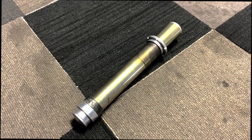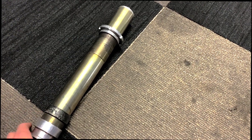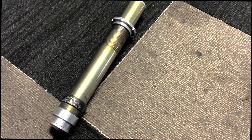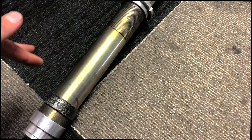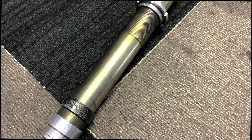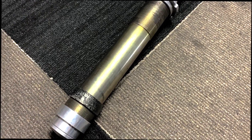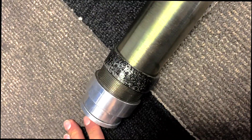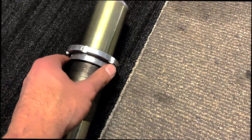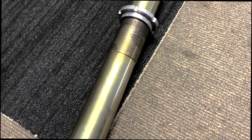Having a bit of a look at how this jack came — you can lock it on the top and there's a bit of pipe around the bottom — that bit of pipe is basically useless, so I'm probably just going to make the mount long enough that we don't need that. We're going to have to make a mount strong enough that the top just sandwiches down the whole thing and squashes it. It's really just this little lift here to lift it on the car, but if it's strong enough something will catch on that, and that nice big chunky lock nut is really just holding it retracting — there's not a lot of force on that.